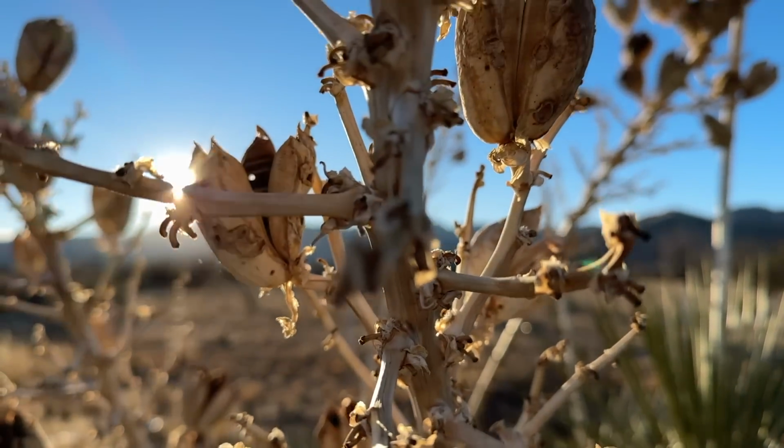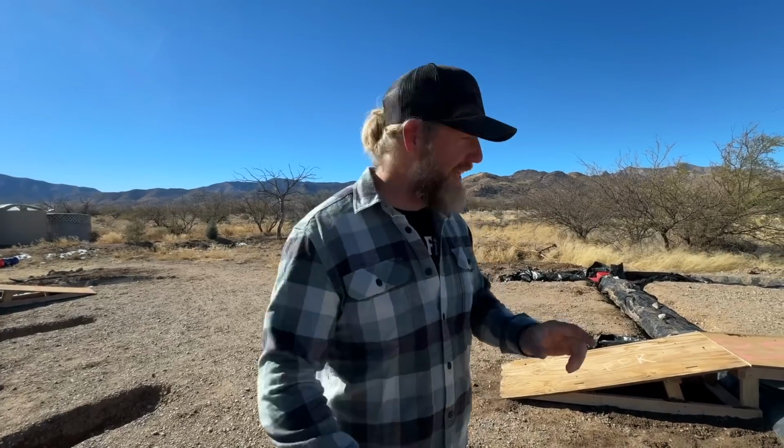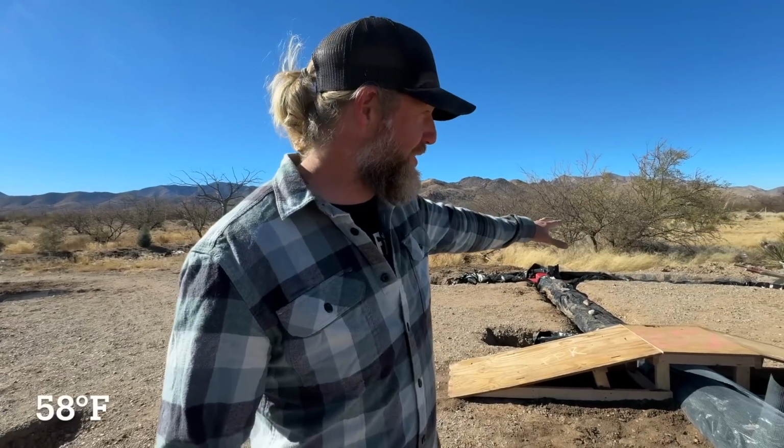We are back out at the roundhouse. Now, yesterday we did this straight wall and we set this ramp, and we also did that straight wall. The reason we have to go in a certain order is because we want to make sure that the bags overlap properly. So even though we just did all the straight walls, we're having to do all the straight walls again so they overlap right, and then we'll get back to the circle bags.